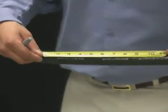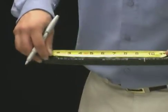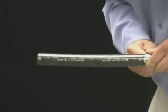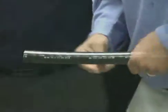Be sure to remove the jacket to the dimensions defined by the cable accessory manufacturer. Apply the spring clamp to the cable jacket at the defined dimension. Use the waxed twine to make a square cut on the jacket at the edge of the clamp.